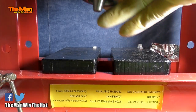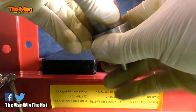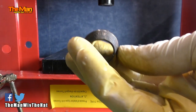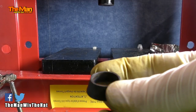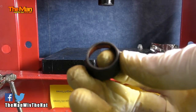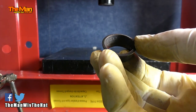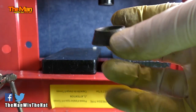Let's have a check — did it come out of the bottom? Yes, it did come out of the bottom. That's why you have a gap between the two blocks. We'll take the coin out — it should come out really nice and easy. And you can see it's now got a really nice deep 17-degree angle fold on the walls. That's where we go to stage three, which is getting the final shape for the ring before preparation, polishing, and filing. So there we go — that's folding of a coin ready for a ring.